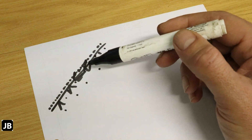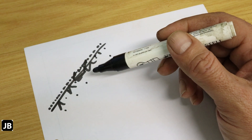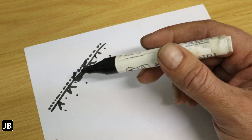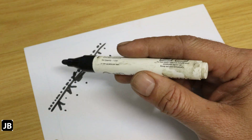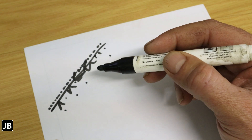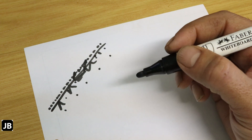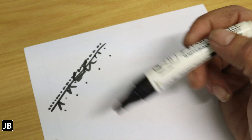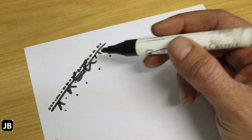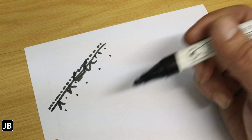With low-grade stainless like your 304 grades and so forth, the corrosive nature of chlorides — like in seawater — attacks that surface layer, and you can actually get rust forming. So if you've got the wrong grade of stainless steel in a marine environment, you will definitely get rust, as we've been seeing on this plate that we're trying to fix up. Let's see if we can do some chemistry on it.